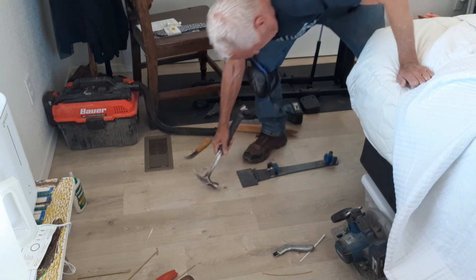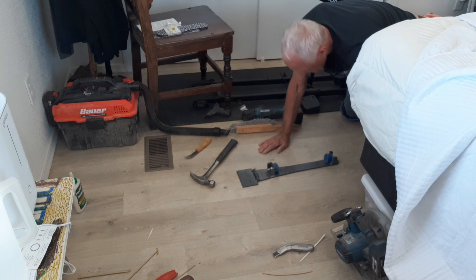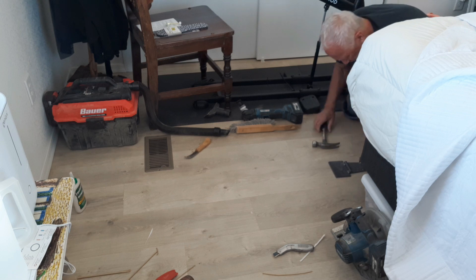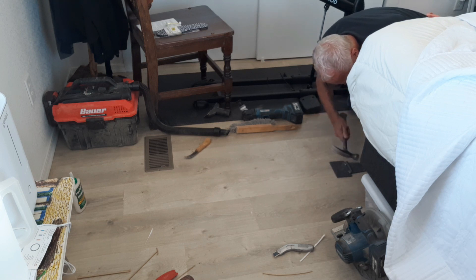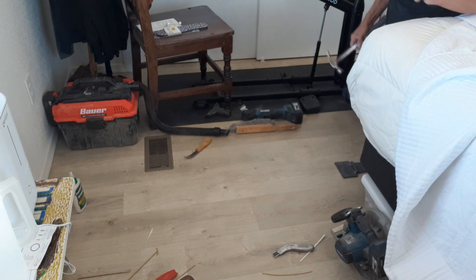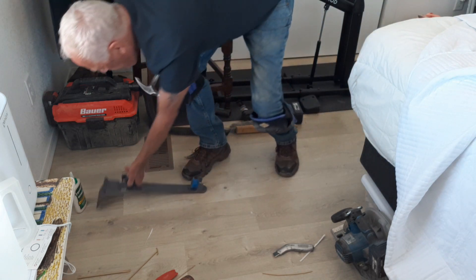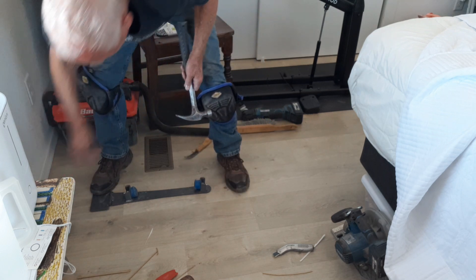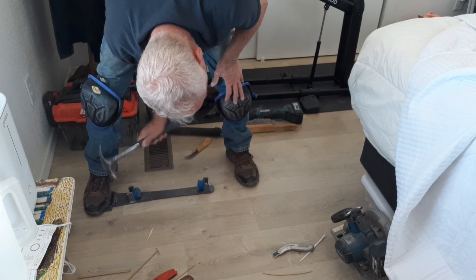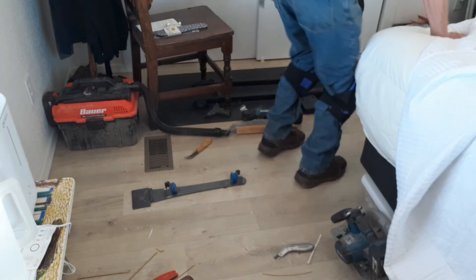This type of product does not have a side lock. With the Unilin locking system it will just slide together and lock really nicely. This is more of a drop-and-lock, so it's kind of a pain to get together. Even though I've cut off part of it, I could have shaved a little more off so it would just slide in and let the glue hold it. Now I'm just trying to get these two planks to go together — if I keep my foot on it, it'll work.